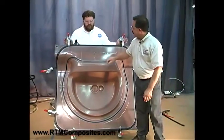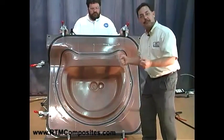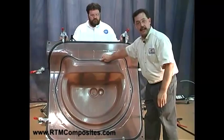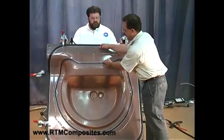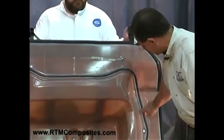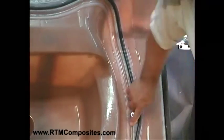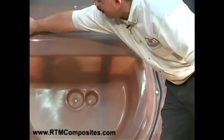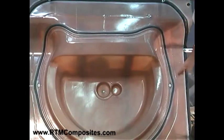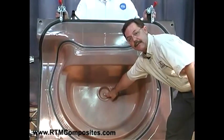We have this area which circumvents outside the mold cavity — this is that clamping suction cup described. We facilitate that with a wing seal and then a dynamic seal, so this area is full vacuum, clamping the mold tight together. Here is a resin channel. We had the two injection ports — one here, one there — so the resin comes in through a channel all the way around the mold. The resin flows into that channel, around there and around here, circumventing the entire cavity, and then the resin will end up at the vent in the center.